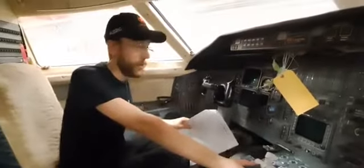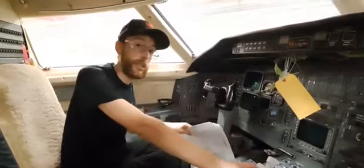We're going to make sure our flaps are up, our slats are in their stowed position, our ground spoilers are off, and our engines are at off. That should be about it. Just tell everybody you're going to power on the airplane and you should be good to go.